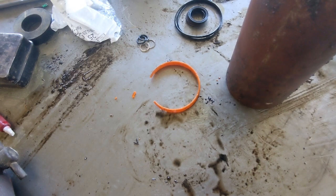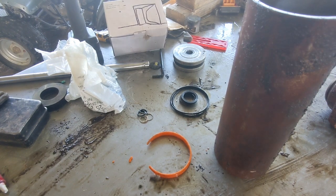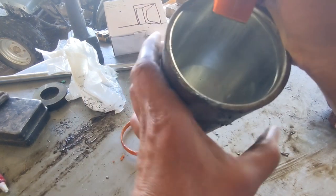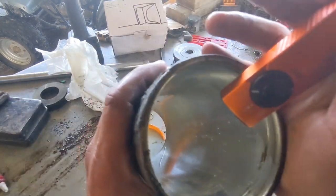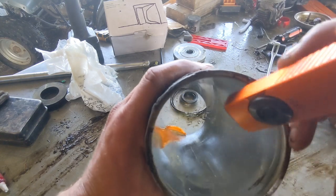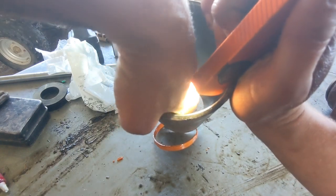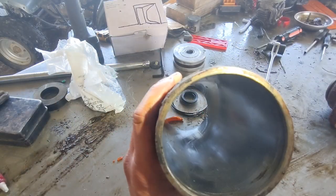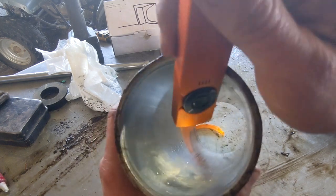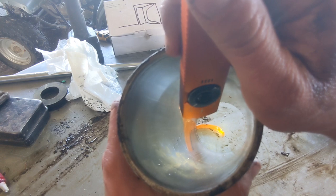But in here, it's going to be really hard to show you this. Maybe if I shine a light on it. Where is it? All right, there. I don't know if you guys can see that, but there's some grooving and a little burr actually inside of that pipe. Now, that is a problem. There, see that little thing? That's not dirt on there. That's actually in the wall of the pipe.